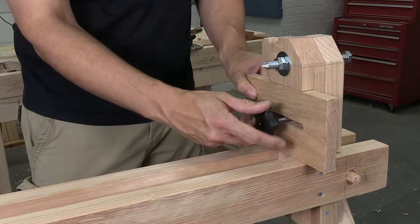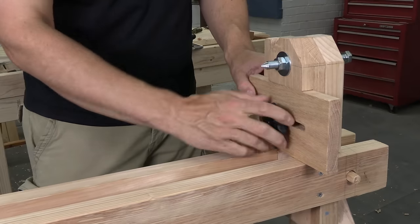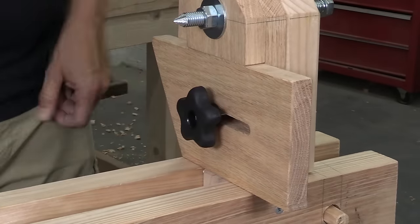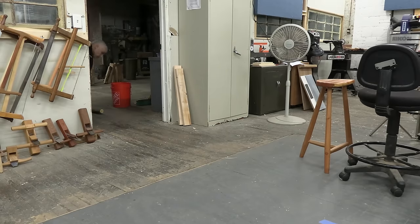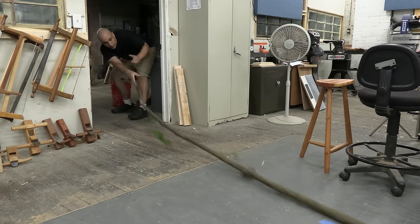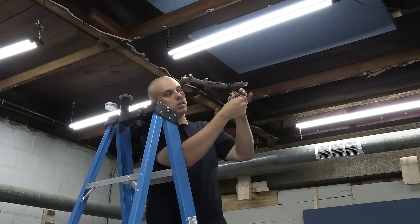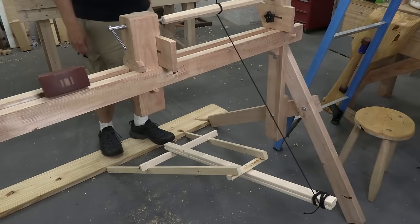The last part was a pair of adjustable tool rest holders. I attached these to the poppet with star knobs, and they let me hold different size tool rests and get the tool rest further away from the work when I'm doing larger diameter pieces. They took a little time to make, but they work really well. Any spring pole lathe needs a good springy pole, and my next-door neighbor was nice enough to let me cut this sapling from her backyard. I jammed it up in the rafters of my shop, using a corner of the building to brace the end. Then I tied a cord to one end, wrapped it around my test piece, and tied the other end to a foot pedal I built out of furring strips and started pedaling.